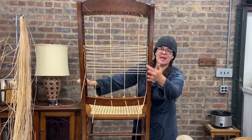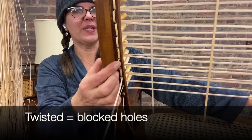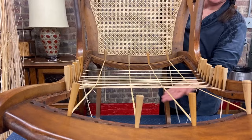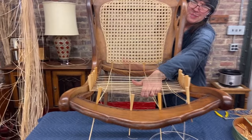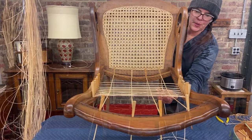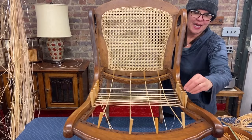This allows me to adjust things later so that these loops are all flush against the back of the chair. It's really important to look at the back of the chair regularly — that's what people are going to see. I have a little tiny bit of a twist, so this is something I can fix easily because I didn't double loop on top. As I get down the chair, these will get progressively looser to accommodate this curve, and same thing at the top. The peg in every hole keeps that loose tension from backing out.